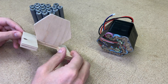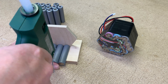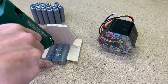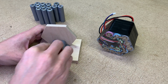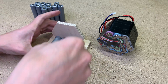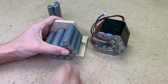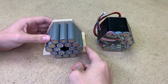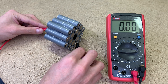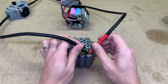To stack and glue cells together, I made a simple jig. The rest was a matter of applying hot glue and stacking cells according to the current battery pack's cell arrangement. Before starting to connect cells in parallel, I made a last check to ensure all cells have the same voltage. Then spot welded in the same pattern as the previous battery.